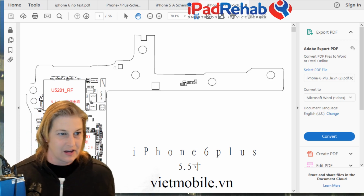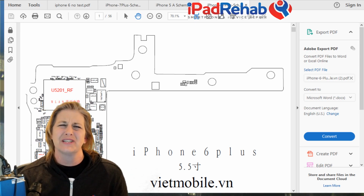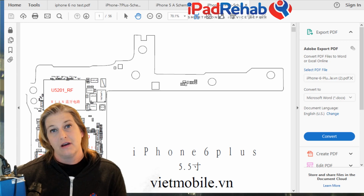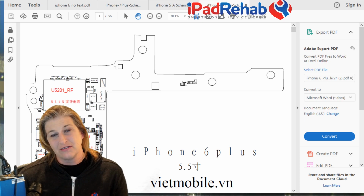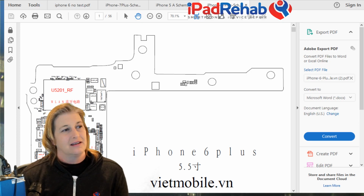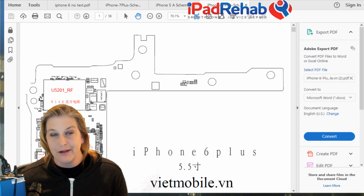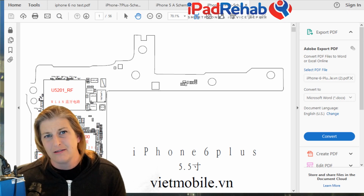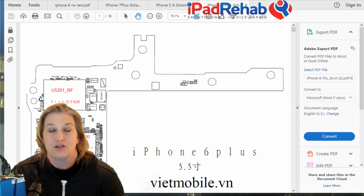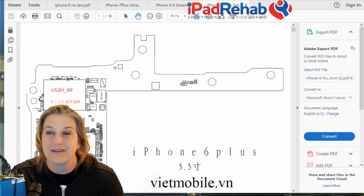Yay! All right. Okay, so alcohol can be used to find a hot cap. Not really for phones, if you're really lucky, but it has to be a really hot short for phones. Most of the shorts that we see in phones are consuming very low battery voltage. Like this short is 1 amp, and the voltage is also really low compared to a MacBook. So MacBooks burn up stuff. They get really hot and they'll boil alcohol. Phones sometimes can if the short is super hot, super strong, but it's nowhere near as crisp and obvious as freeze spray, which took us right to the exact spot. And we wasted so much time trying to find it using other methods. I mean, even your face could have found that before the thermal camera.